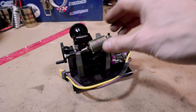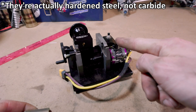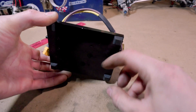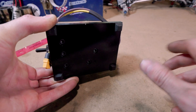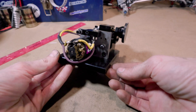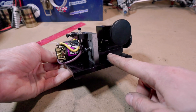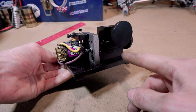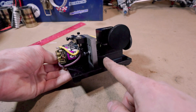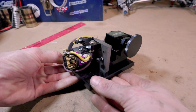To get my 550 armature to fit in the lathe here, what's going to have to happen is I'm going to have to move this carbide support over about half an inch. It shouldn't be too difficult — it's got a mounting hole on the bottom and two locating pins, so those won't be too difficult to transfer over. However, there are also two bolts right down here that attach the carbide block to the ways. Once this gets moved over, I'm going to need to make a spacer block that goes between the carbide and the ways, and that should be what keeps the two carbide blocks nice and parallel to each other.